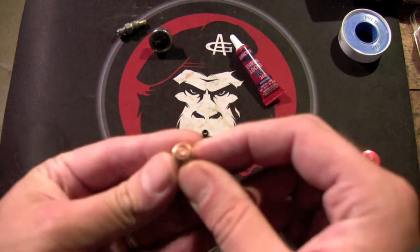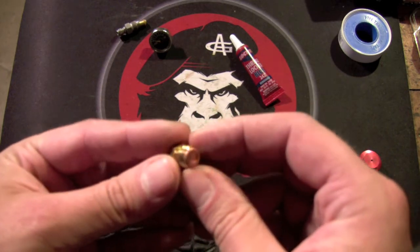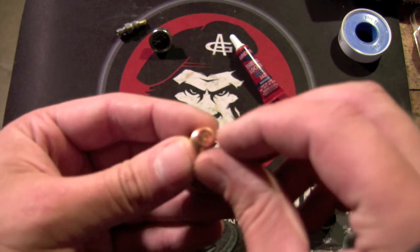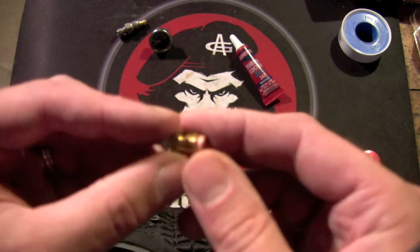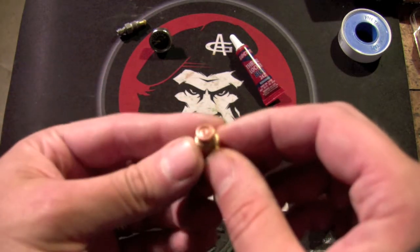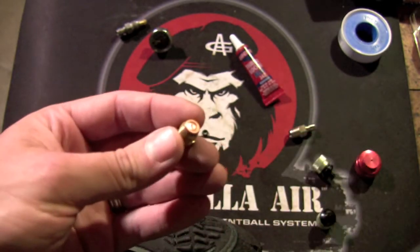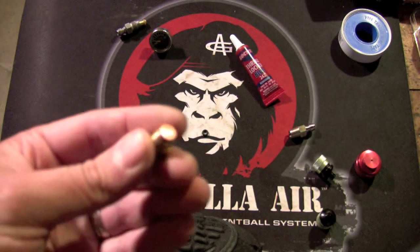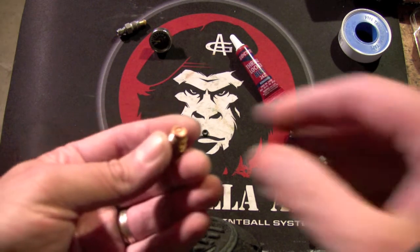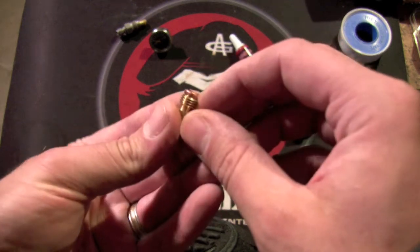But how a burst disc works is essentially when that debris comes through, or you have some problem, you've got a foil cover on the back of this burst disc. And so you basically have that material rated for that level of pressure. I don't know if it's exactly like this, but the best analogy I have is sort of like a 12 gram where you pierce that and then the gas flows out. So you have sort of a foil-like material on the back of this burst disc.